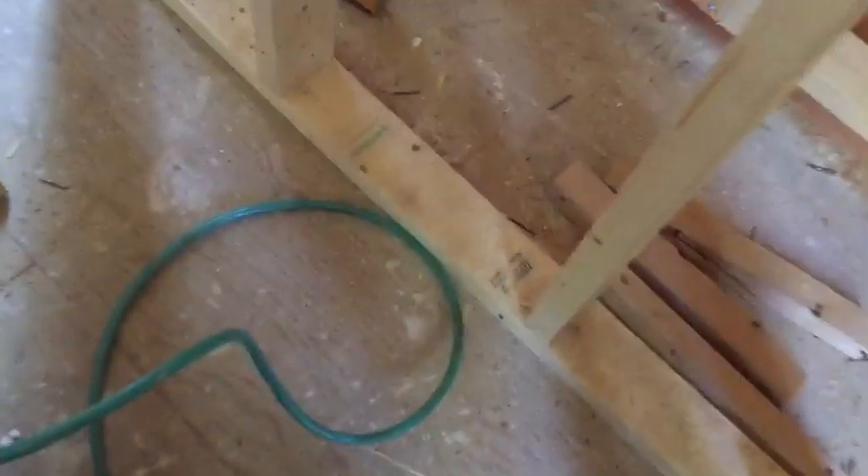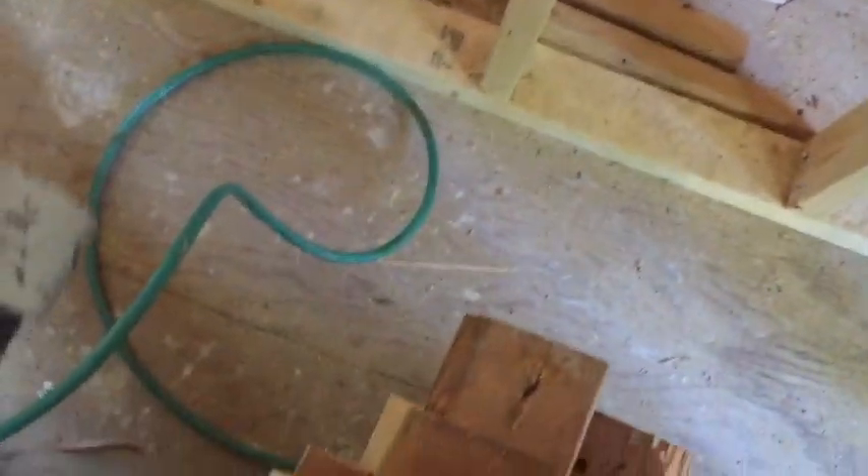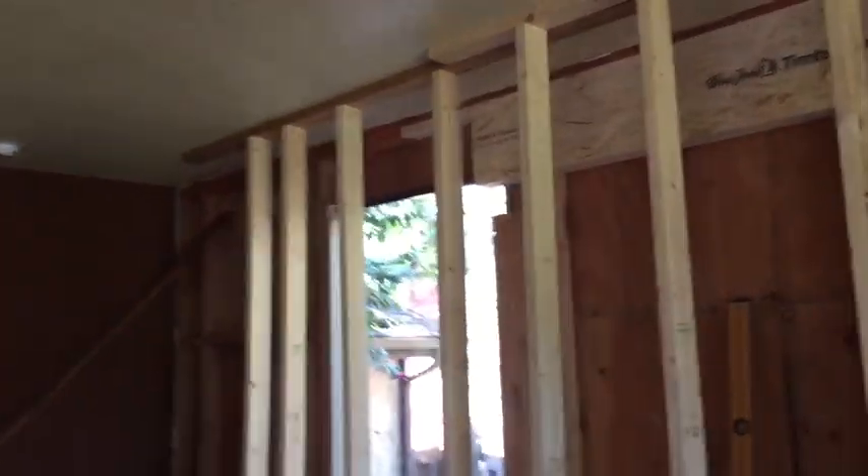When you're cutting your outside wall away, make sure that if your blade starts pinching, your temporary wall is not holding the upper level. You've got to be careful because you might have some serious problems later — sagging and cracking of drywall, and who knows, even collapse. So be careful.